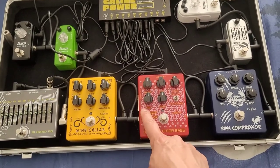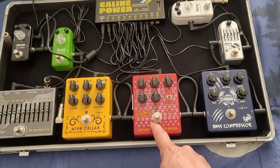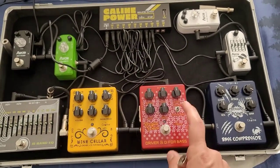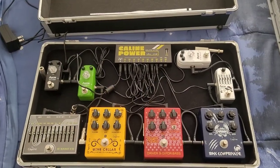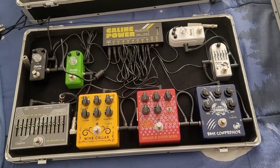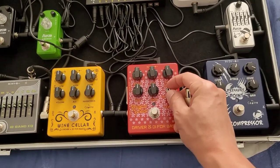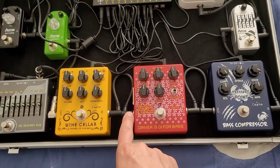To touch upon the XLR output: as mentioned, this has an analog signal ground reference to pin one, which is wrong. The best way to solve it, if you don't want to do anything inside the board to remove that pin one wire from analog signal ground, is to use an adapter like this from HOSA — it's a GLT255. All it does is disconnect pin one from the XLR, so you don't have any connection of the analog ground to the chassis ground back at the mixer. I did get the schematics for the Press Pass but it was for an older version of the board, and I can't imagine the updated version is going to be that much different. The core issue with the ground switch is still a problem, but it can be overcome with a simple adapter like this. Just know that with the switch in the down position you have full volume, and with the switch up you get 6 dB of reduction on the outputs of the quarter inch and XLR respectively.